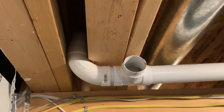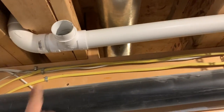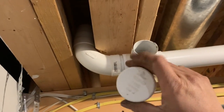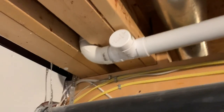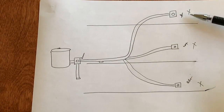We fed the auger down towards the garage, shook stuff up, and activated the vacuum cleaner to see if it could suck through any debris in that line. We also traced the auger back the other direction as far as we could go — same sort of thing, move stuff around, activate the vacuum, and try to clean it up. This end cap allows us to look for debris and clean it out. After checking that, we came back to the diagram and the same problem remained — it hadn't been fixed.